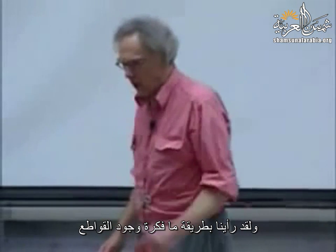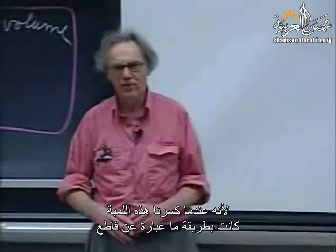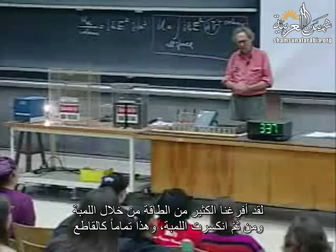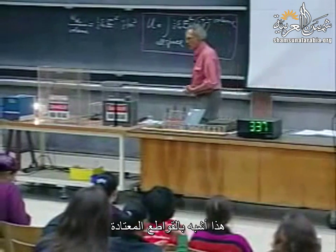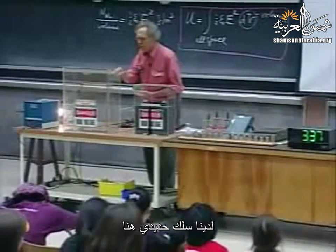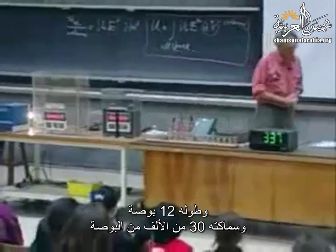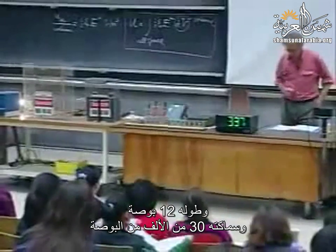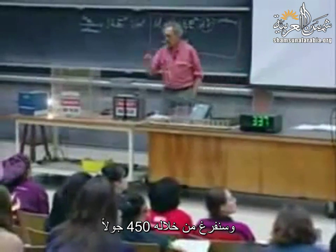And we already showed, in a way, the idea of a fuse, because when we broke this light bulb, that was, in a way, a fuse. We dumped too much energy through that light bulb, and so the light bulb itself was already like a fuse. This is really more like a fuse that we are used to. We have a wire there, which is an iron wire, which is 12 inches long, and it has a thickness of 30 thousandths of an inch. And we're going to dump the 450 joules through that wire.